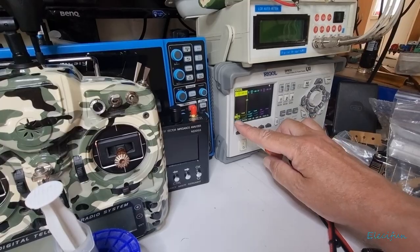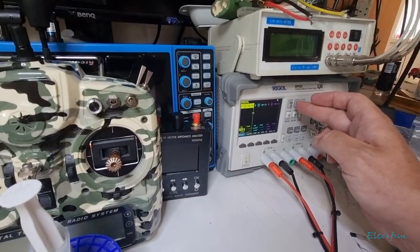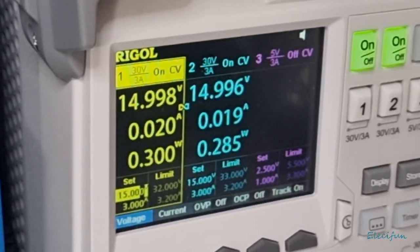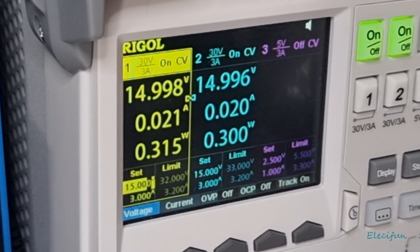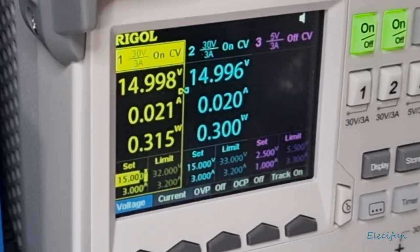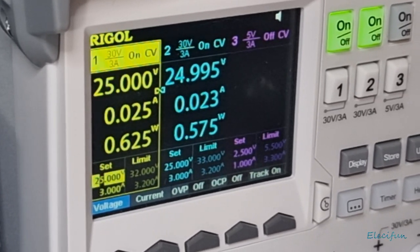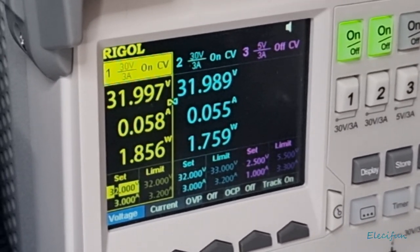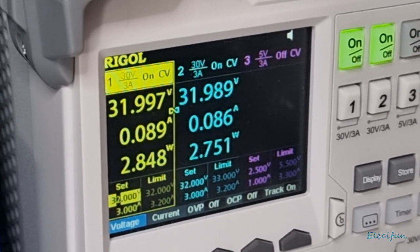All right, that's enabled and we're on 15 volts already, so that's good enough. We'll start off with 15 volts and have a look at the quiescent current. Let me zoom in so you can see — we're just looking at the amperage, and this is for one channel. So combined we've got about 40 milliamp quiescent current at 15 volts. Now let's start turning the voltage up — we're going to go for 30... 32 volts, and we can see that the quiescent current is going up.